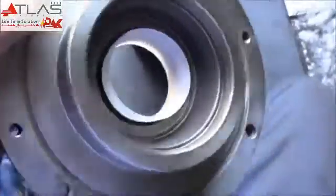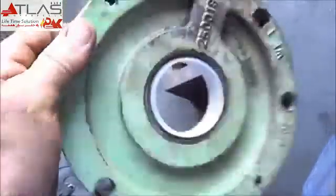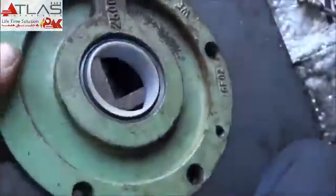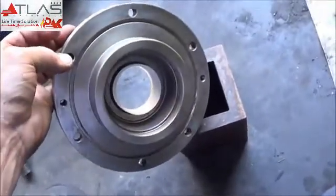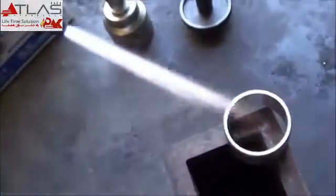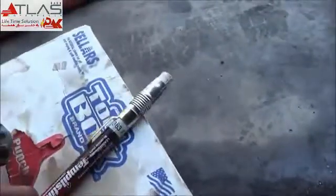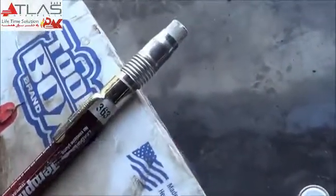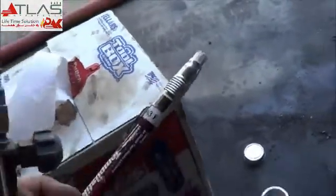If you watch the Seal Air video — on the other end here it's just flush mounted. So now what we just got to do is get the new wear sleeve on the shaft and then put it all back together. I'm going to heat the wear sleeve with this torch right here. I've got this pencil that melts at about 360 degrees, which would be better if it was about 250, but it's good enough. This kind of gets in the ballpark — you don't really need it, but I'm going to use it anyway.